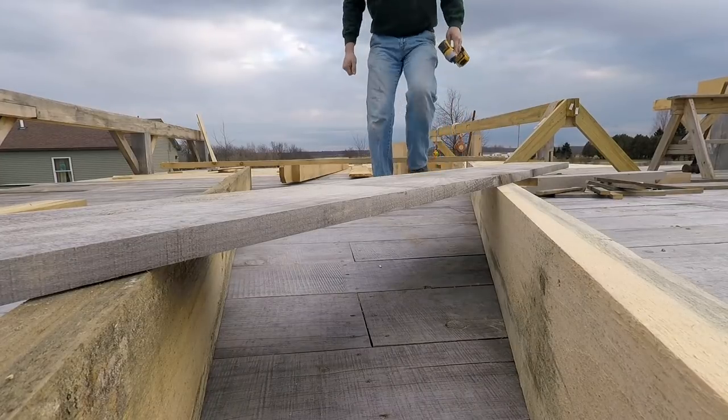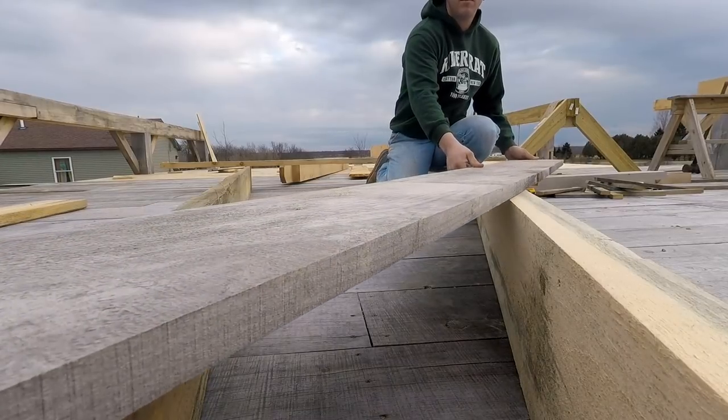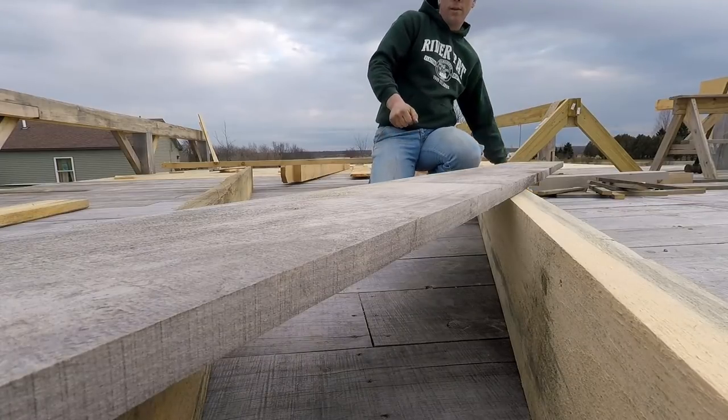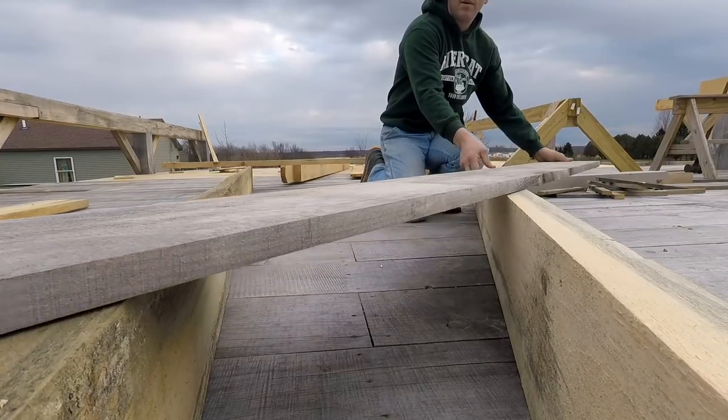And the lumber I'm using is white pine. The main support, the uprights, are 2x8 white pine, but it's all sapwood and there's virtually no knots in it. You may get a couple of 1 inches here and there, but that's about it.